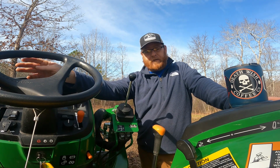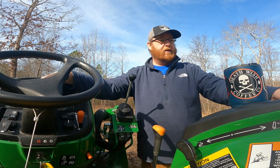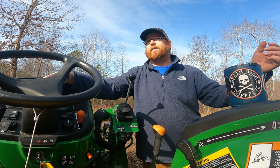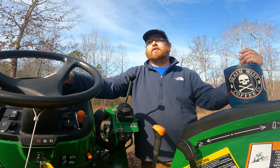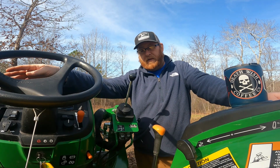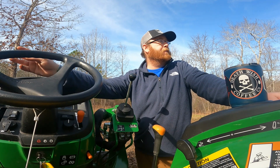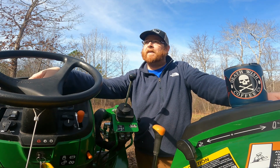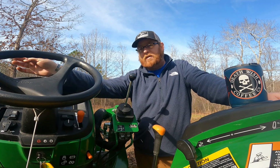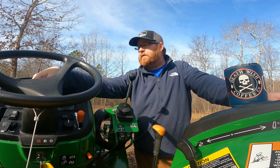The tractor has a fairly regular scheduled maintenance for regen, and it fully alarms and lets you know. If you're operating the tractor like they tell you to, between 2,000 and 2,500 RPMs, you're rarely ever going to have to do a manual force regen. The regens that I've been through, I've been bush hogging, or doing some sort of labor intensive work with a box blade or clearing work, and it's just done it. You can tell the tractor's doing it, but it doesn't slow down your work in the least bit.